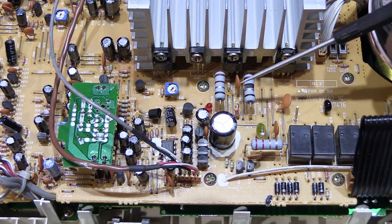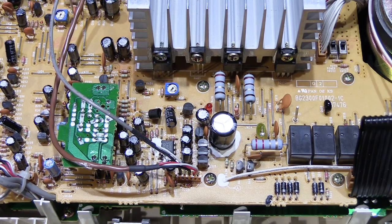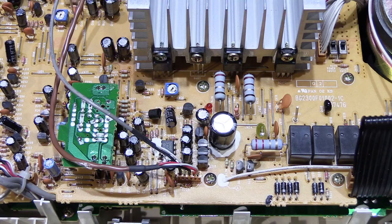One of the things you have to think about is why did the amplifier fail? It probably failed because Ed had lightning that hit a power pole or something to do with his utility line, and he got a power surge through the transformers into the set that killed different components in the amplifier. Now there's a dead short in the amplifier drawing too much current, which is why the transformers get hot and nothing works. We get a lot of 3303s in with failed amplifiers — you can see in the picture from our website where red arrows point to components that typically fail, including those two resistors with burnt-off covers.